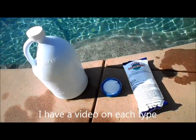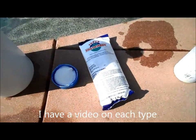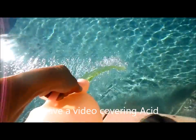And this pool had no chlorine, so you can either bring it up with a gallon of liquid chlorine, you can use some dichlor, or a bag of shock. Okay, and after doing the acid demand test, you want to add the acid. You want to pour it in the deep end, and you want to walk away from it because it is toxic.